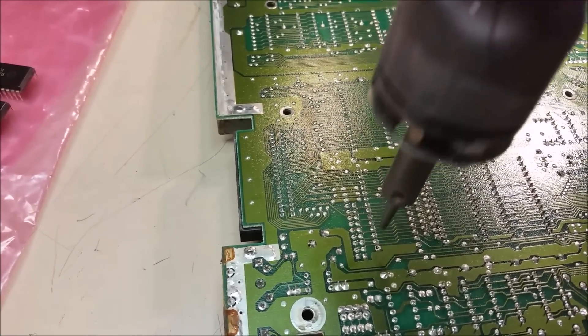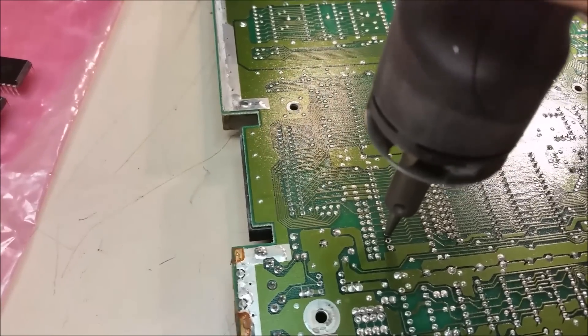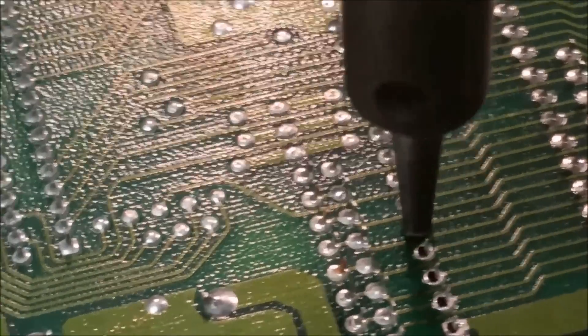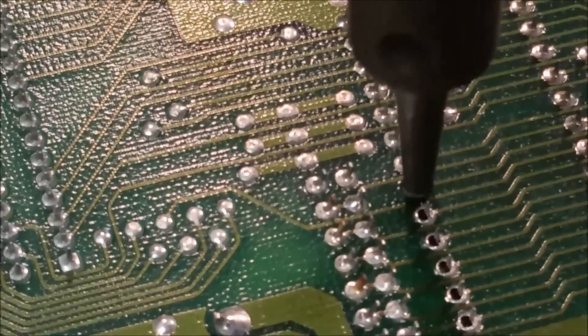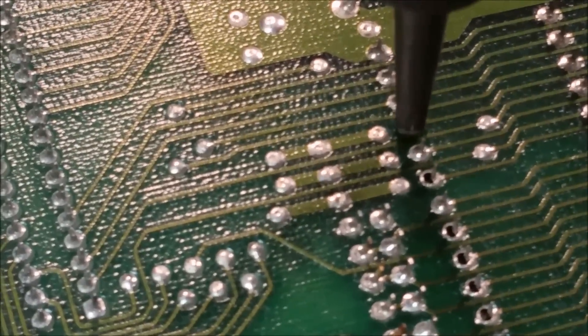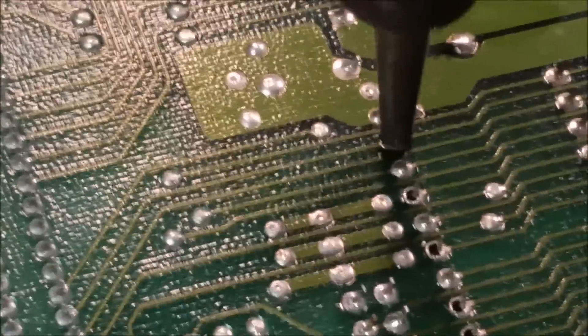Put it on there, squibble over it, suck it up — that's kind of how it works. This sure beats solder wick by a long shot. You've got to be careful with it though, otherwise you tear up your boards and your pads. Some people actually alternate pads so the board doesn't get too hot in one area.